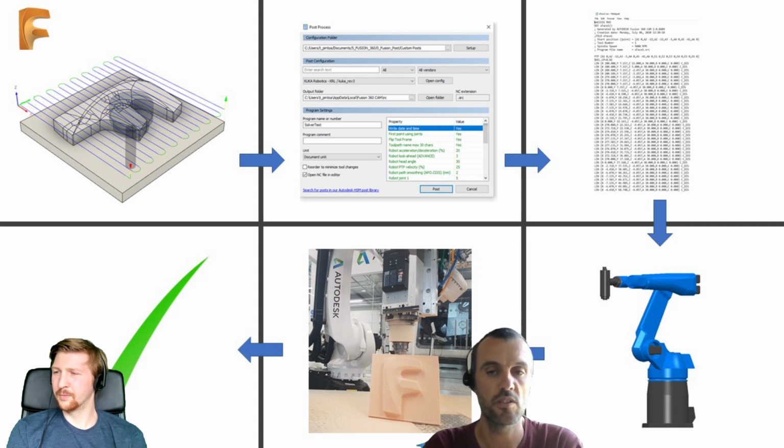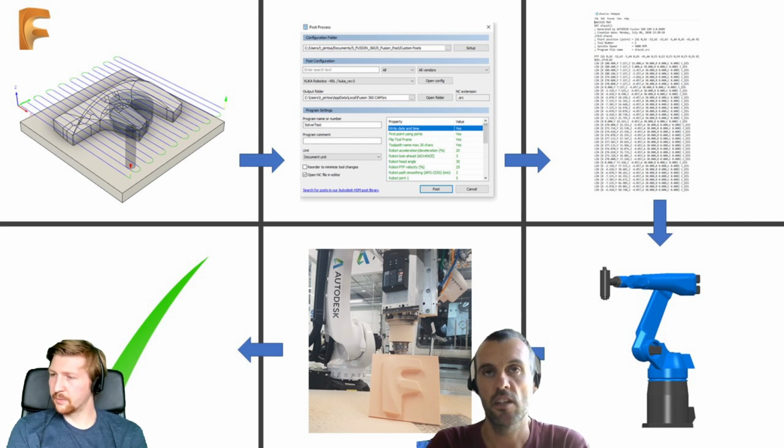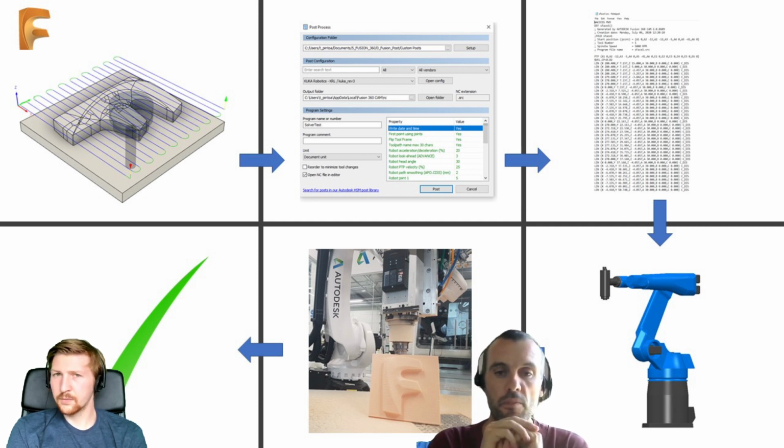They all do the same thing, which is drive the tool to a specific position, a Cartesian position, relative to that coordinate system you define on the part. So provided that the coordinate system defined on the robot matches what you've defined in Fusion, the robot will go to that position. So they have their own language name, and the syntax is slightly different, but they all do the same thing, basically. Perfect.